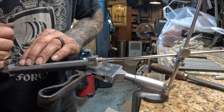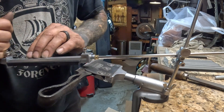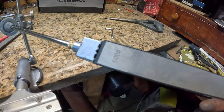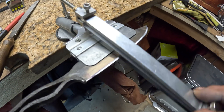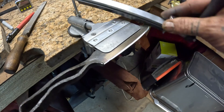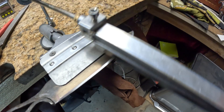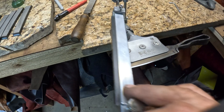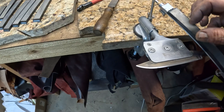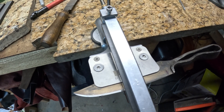I just try to make smooth strokes. I drew a little line on the blade with a marker to show me where I'm starting from. Now I'm using a 600 — I put a Sharpie line on my edge just to see if I have any low spots, if I'm nice and even — and it appears that yeah, it's all good. This is the final 3000. I think that's pretty sharp. I'm going to put on a little leather strop and then I'll probably be just about done.